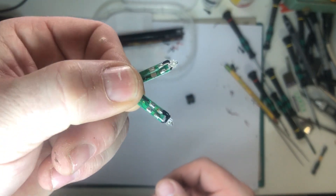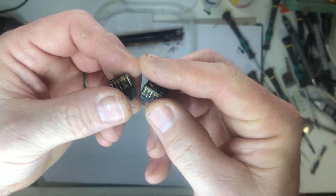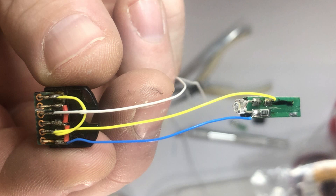Here are the two ends with the two white lights from either end. I've cut the printed circuit board and just left those two, and de-wired all the LEDs. We have to remember the cathode and anode - the positive side of those LEDs - so we can wire them up correctly. I've fitted a resistor in front of the positive lead to the bottom white light. That blue wire is where power comes from, so the blue wire goes to the white light and then I link the yellow. So the two white lights are on the yellow wire. That goes back to the printed circuit board - the yellow wire connects from the decoder and the blue from the decoder. Then I've put the white wire for the red light, and I'll do the same with the other end but opposite using the white.